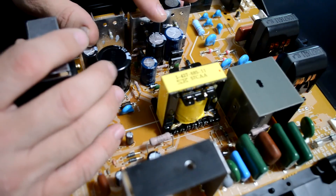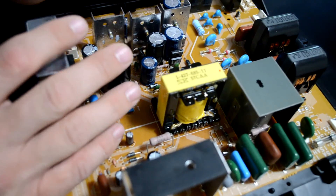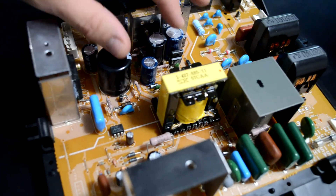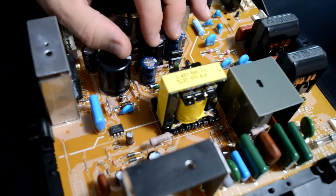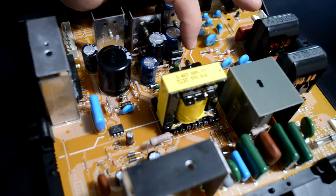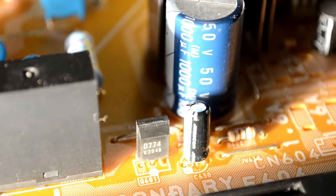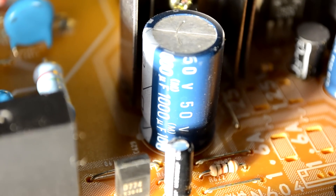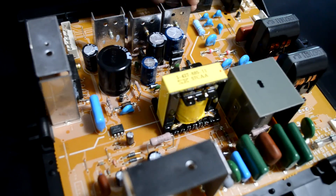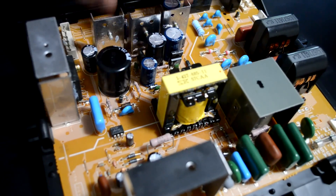This 1351Q is kind of a strange, not-too-often-documented monitor. I couldn't find the exact capacitor list in any of the manuals related to this monitor. So just to be safe, I went and recorded the value written on the side of each capacitor. Once I recorded that down, I found a high-quality replacement on Mouser.com.